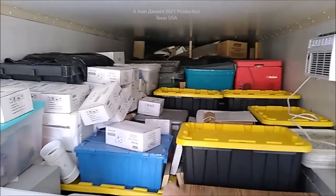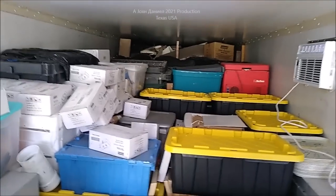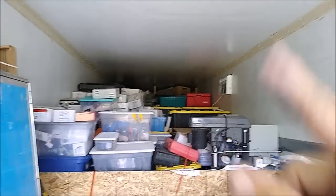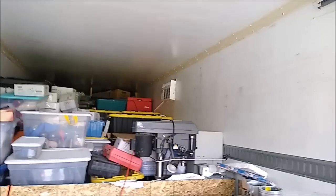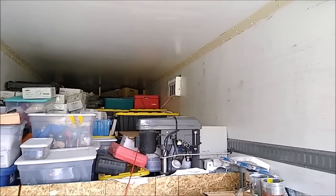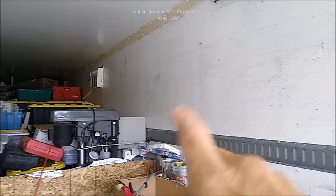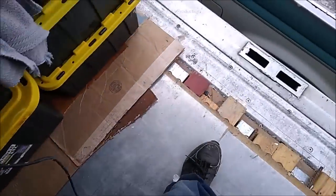I've just got 50 feet of 14-gauge wire hooked to it — that's enough. It only pulls 550 max watts. Everything you see in the last 35 feet inside here is food — now you'll know why this thing has to be in here. Plus when I turn it into my workshop you'll see a lot of videos on it. We're going to be putting a full standard roof on this, another two and a half inches of foam on the ceiling, and enclosing it with regular metal, plus an additional half inch of ISO foam. It currently has an R-factor of 15.9 — basically R16 — but we're going to bring it up to about R20. The ceiling is already R22 and we're going to bring that up to R26 or 28. The floor is R30.